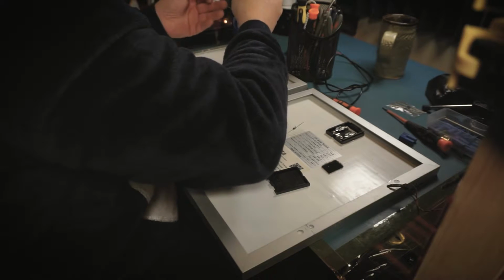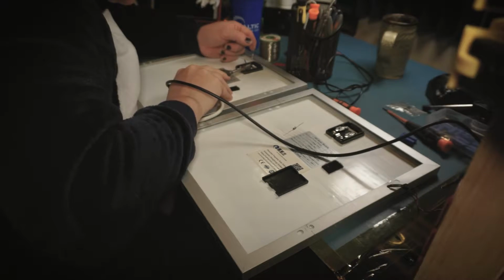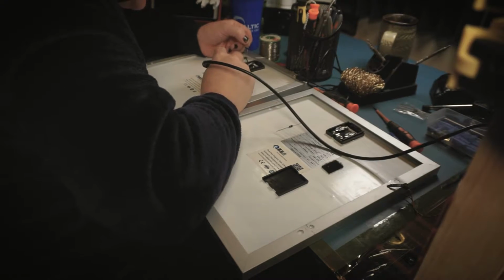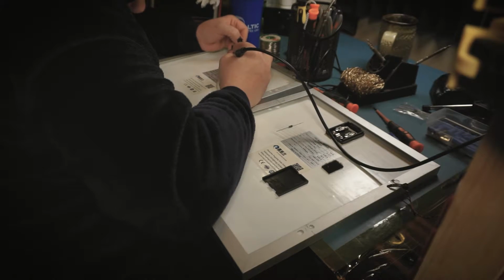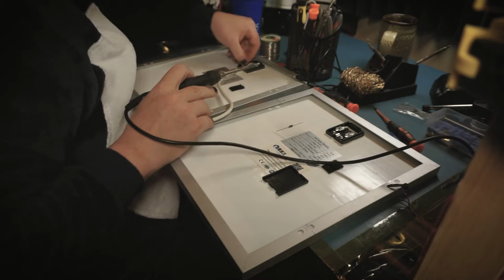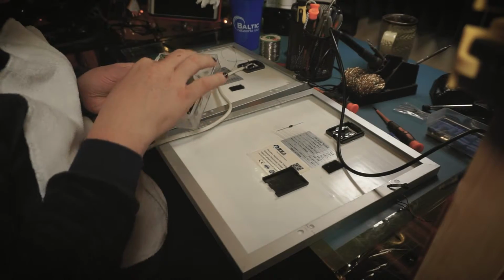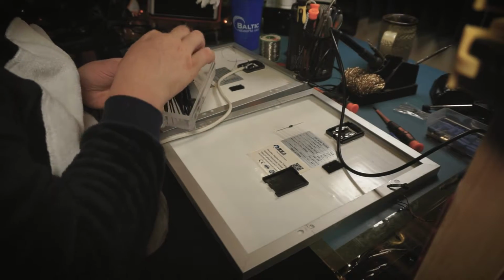Okay, so I'm gonna grab some solder here. I'm gonna grab my soldering iron. We're gonna tin this wire first. I'm just gonna get on here. Actually, I should bring this over so that I can, there. Clean that up. And there we go. Tally-ho. This is just lamp cord, but sometimes it doesn't stick. Okay, so I'm just gonna, wow, I've got the temperature clearly a little bit too high there. All right, we got it down to 390. I'm gonna grab a set of tweezers here.